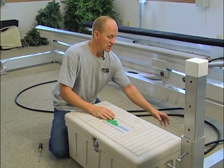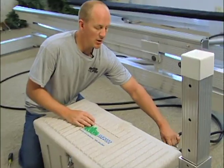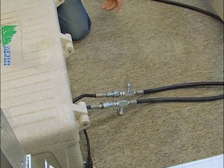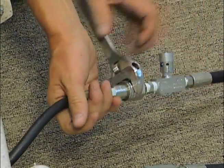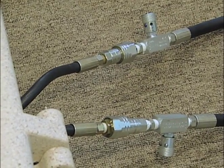Usually if this happens, the screw couplers that connect the pump and the lift together are not tight. Make sure you take a wrench and tighten the couplers up, making sure that they feed together tight.